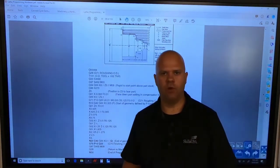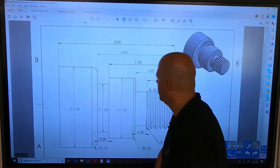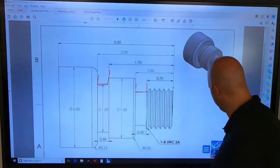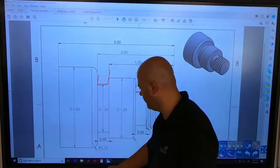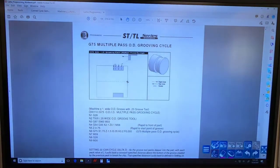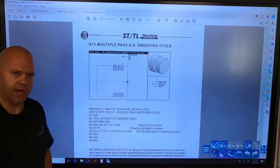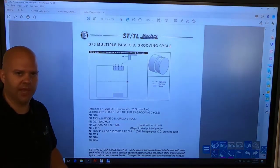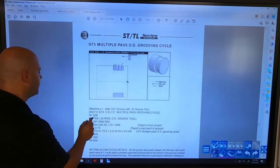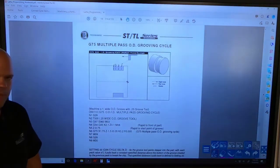Now that we've ran this tool, I'm going to turn off my coolant and send the machine home with G28. Depending on what machine you're on, for this machine we send it home in U0 W0. Let's look back at our Haas programming workbook — it just has G28 and turns on constant spindle speed. We did our P, our N10, N20, G40 to turn it off. We pretty much did that whole thing on that one part.